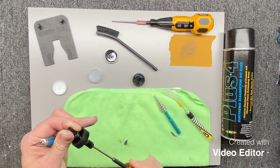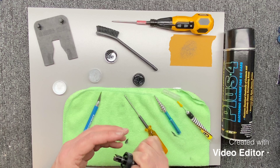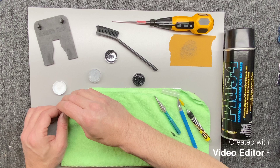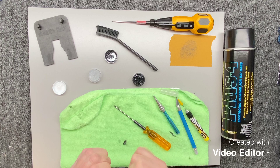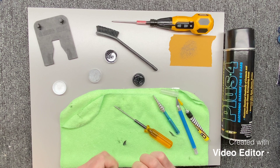Now I'm just going to start to snug this a little bit — I don't really feel a lot of resistance yet. I want to work it and make sure everything's good and free, nothing's binding. You don't want anything binding; if it's binding now it's only going to get worse. I'm going to wipe out these out drives — this one gets a little black grease in it from the thrust when you install it. I'm going to work it and feel it; I want to feel if there's any notchiness like something's not right in there. But it feels perfect.